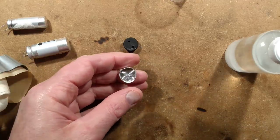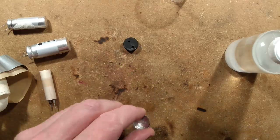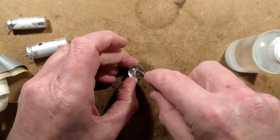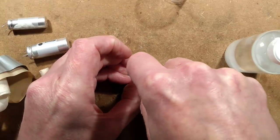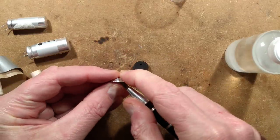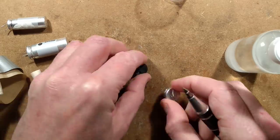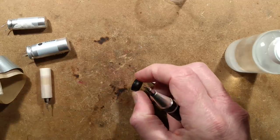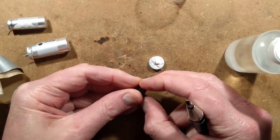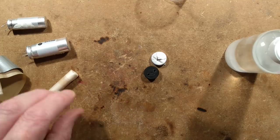So when pressure is applied to that — if I was to basically sit it on something like one of those rubber bungs and then just press down — yeah, that just split open. So that is designed to split open like that, and that vents the pressure. The other option is that the rubber bung can pop out the bottom, which is also equally common. If it happens slowly, the rubber bung just tends to gradually slide out and then it splurges electrolyte all over the circuit board, which is not good because it's conductive.